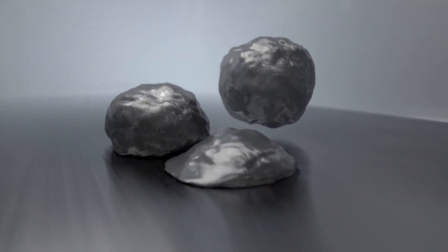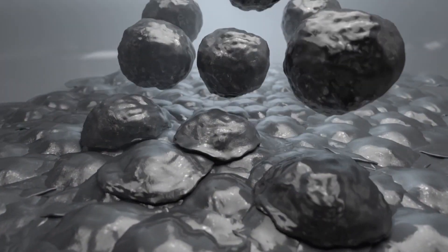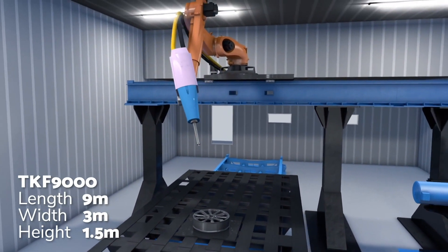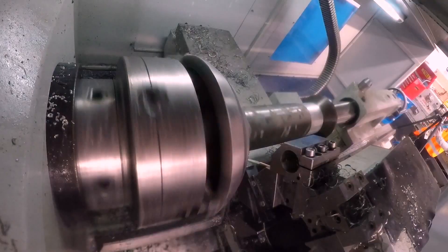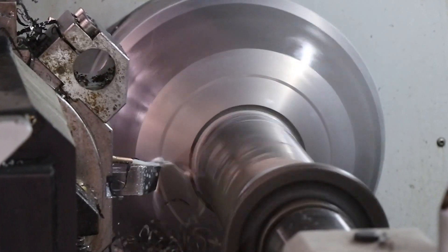As these particles build layer upon layer, they fuse together to rapidly form strong, dense, 3D metal industrial-scale parts at a rate of up to 75 kilos per hour at unparalleled size. As the parts are manufactured, they are built to near their final shape, then precision machined to final tolerance, removing up to 5 to 10% of material.